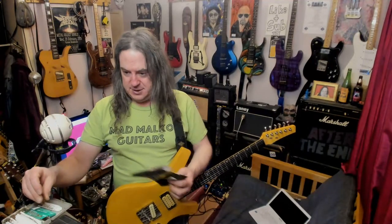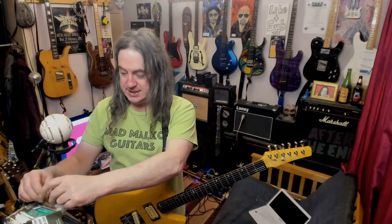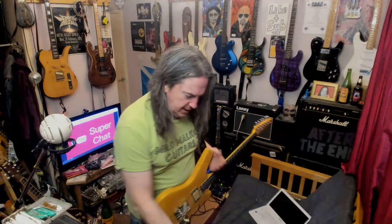I used to get it with guitars, and I got it with wiring, putting my stereo together. I was told so many times. I think it was Josie Warman that really got me into the mad guitar wiring thing. I thought, I want to put blah blah blah. Is there any way of putting, like, I've got this Flying V and I've got two sets of quad rail humbuckers, so there's basically four coils in each pickup. I want an on and off switch to put them all in series to make one massive 8-coil humbucker.